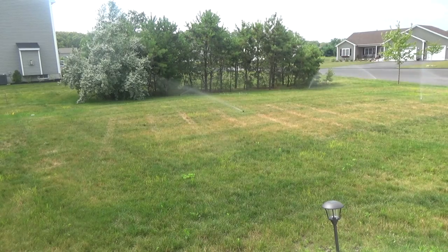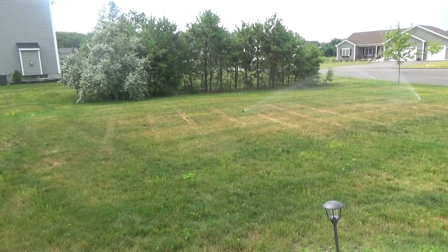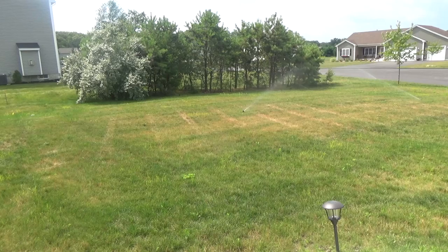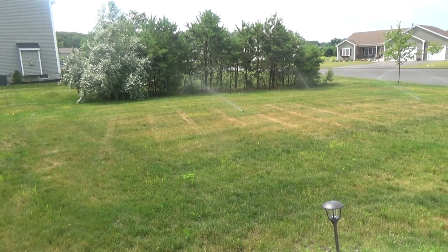It's a new system and I was impressed with how good it was. What I think is happening is along the edges where the trees and the house are, that area is getting shade, so that's why it's not browning as quick. Ultimately what we figured out is we looked at their system and the rain sensor was detecting rain and turning off the sprinklers. The problem is our weather — it's been raining frequently but very little, but it was just enough to make the sensor go off and stop watering.